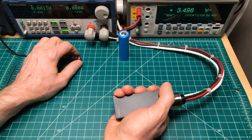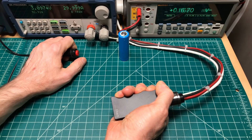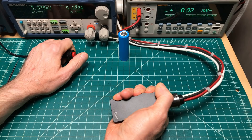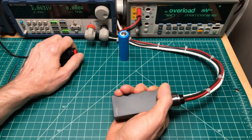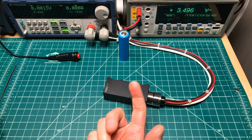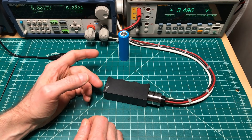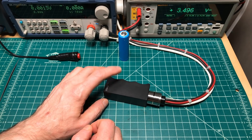Zero volts confirmed. I fire a pulse — 0.165. About 0.165 again. 0.165 — very consistent, which is always good to see. About 0.165 — boy, it doesn't get more consistent than that. That's fantastic, because some mechs, if you're pressing really hard you get a very low resistance reading, but if you press gently it's two or even three times the voltage drop. This one was extremely consistent at 0.165.